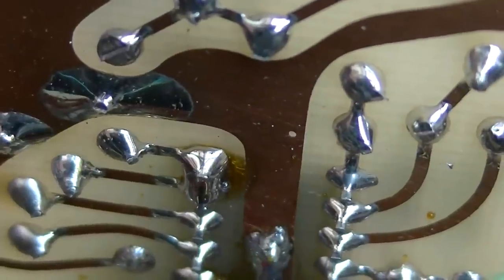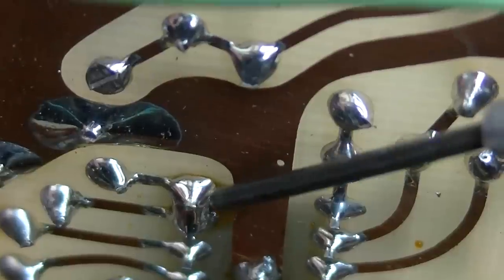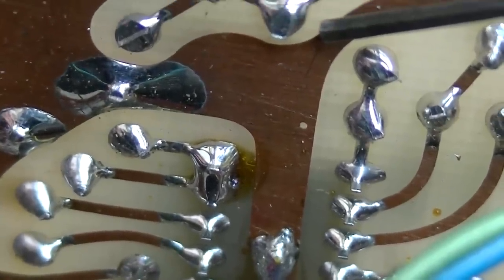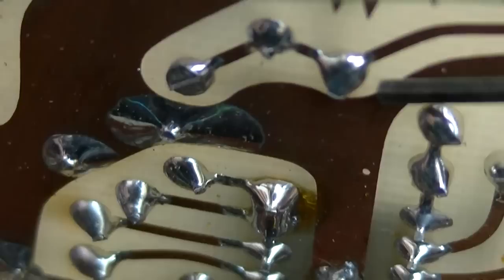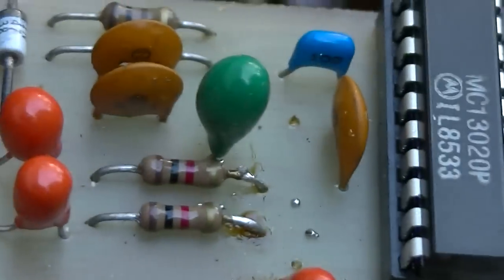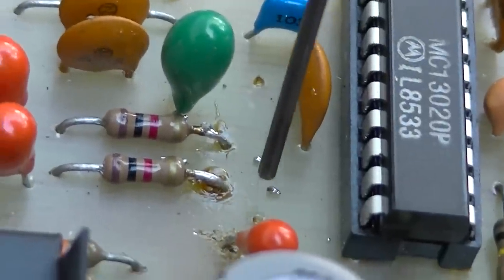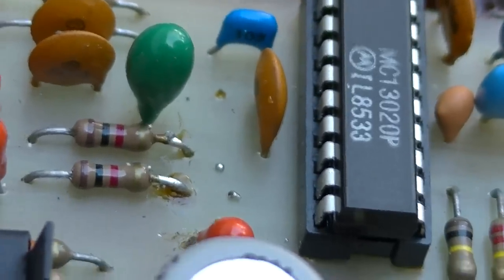And this is kind of interesting because you can see somebody bridged pin 9 and 10 together. And notice how there's a big blob of flux there that there isn't anywhere else on this board, really. Notice how there's flux there? And I also, if you look at the top here, you can see where that resistor was. That resistor, that 100K resistor, was between here and here. So, what's going on with this?